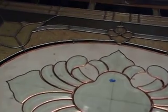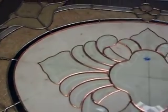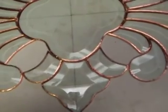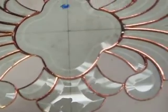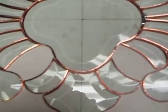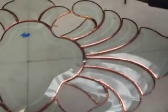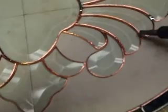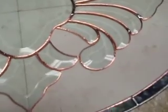Now I'm going to start tack soldering. This is kind of tricky because I'm recording in one hand and soldering in the other. Just to give you an idea of what this looks like — I'm going to need both hands when I solder. I'm tack soldering, just keeping it so that it doesn't move around on me. That's the purpose of tack soldering. You'll come back later and solder it up properly. For right now, this is just keeping my pieces in place.